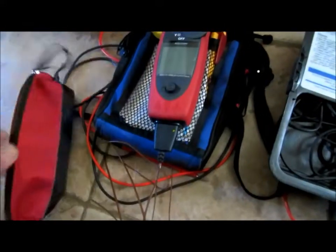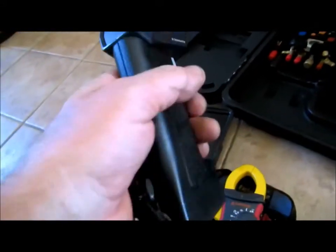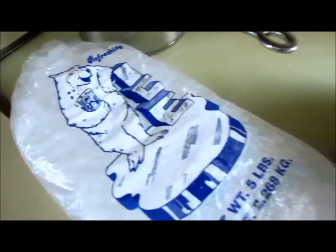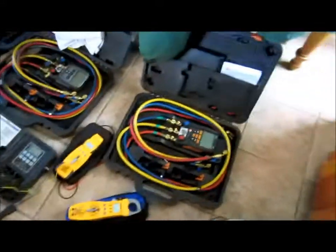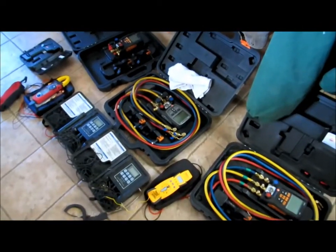I've also got my little Cooper handheld device. That's enough to play around with for today. Here's how I'm going to test: I'm going to do an ice bath — put ice in there, bought a bag of ice, add a little bit of water, and with all that ice and water we should be right around 32 degrees, maybe 32.5 or 33. That's close enough for what I do, to see if these sensing bulbs are accurate. As Eddie says, if you're not testing you're guessing.